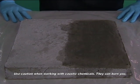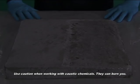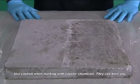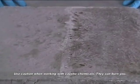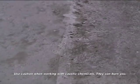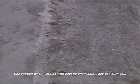After all has been rinsed out, let the pond dry for a few days. The drier the surface, the better the pond shield will bond to it. Here you can see the difference between the clean concrete and the unclean concrete. This is what you are looking for.